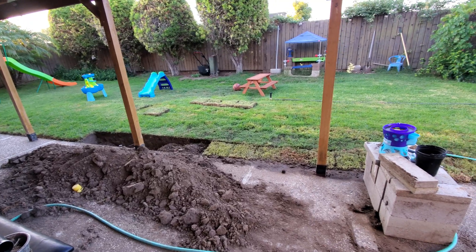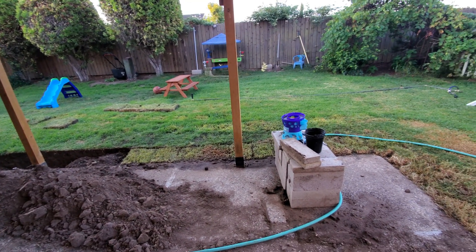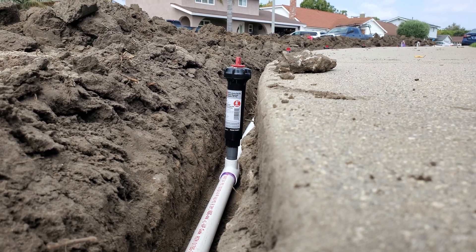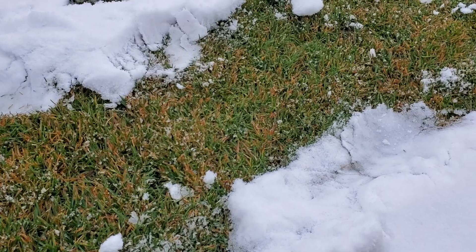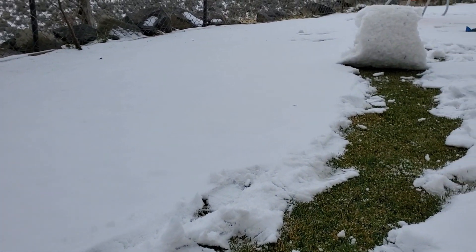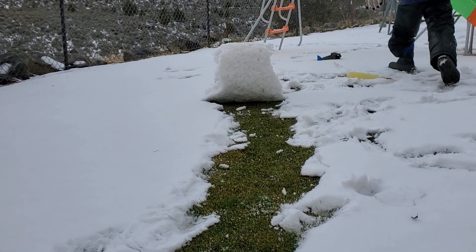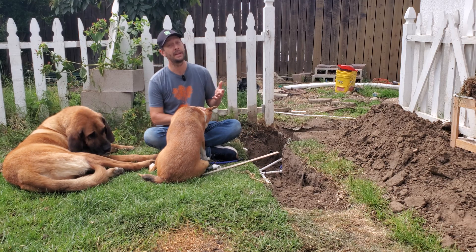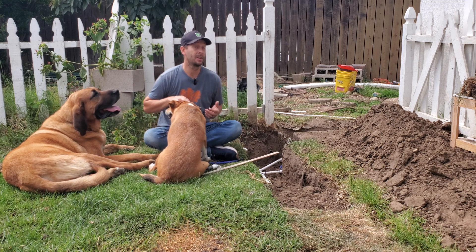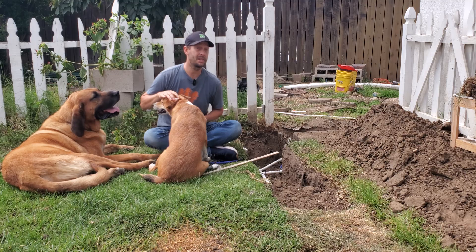If I just left you with 8 to 12 inches underground, I'm leaving a lot of context out. If you live in an area where you have freeze-thaw cycles of true winter, then you do want your sprinkler pipes to be a little bit lower in the ground, closer to that 12-inch mark. If you run half-inch pipes, especially in areas that freeze a lot, you're also going to want to keep that down close to the 12, maybe 14-inch range.